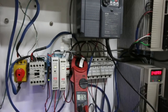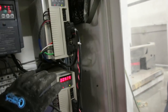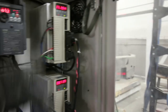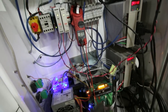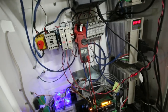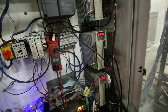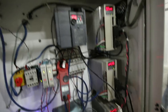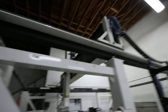I'm also talking a bit about the inner workings of the CNC machine. These are the individual controllers for the servo motors that drive every axis — three of them for a three-axis CNC machine. The main computer has all the g-code in it and gives these controllers the signal to drive the servo motors in a certain way and spin the spindle at a certain RPM — that's how the three axes move and the whole machine cuts things.